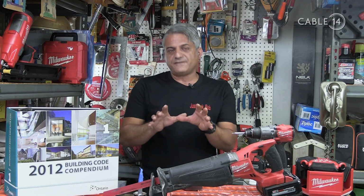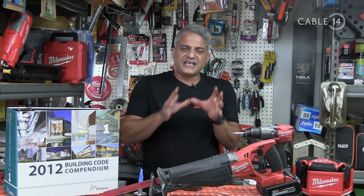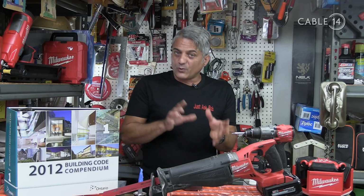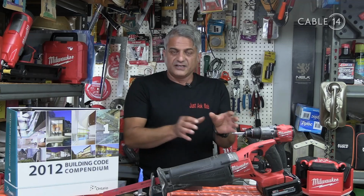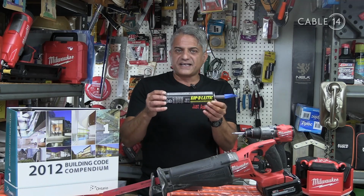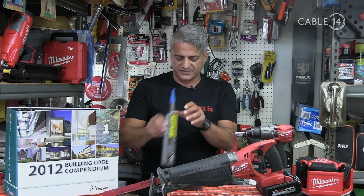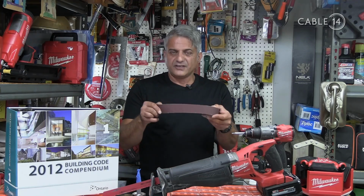Let's talk about some top picks now. A lot of customers and a lot of homeowners, in my experience, just need to have the miters or the joint sealed. So it's that irritating drip, drip, drip after you've had a rainfall. And in the wintertime, it can be dangerous because it can cause a freeze-thaw, usually at the walkway. So in order to repair your eavestroughs, you're going to need copper elastic. This caulking is amazing. It will seal out the leak. However, you have to be careful when you use it. You need to use some sandpaper on the joint. You must clean it off.